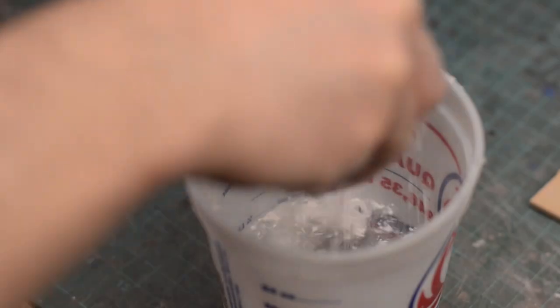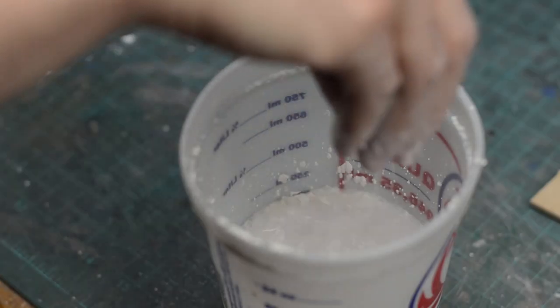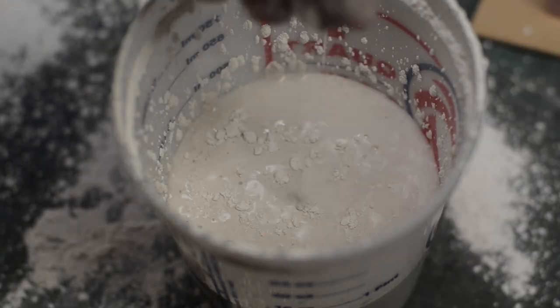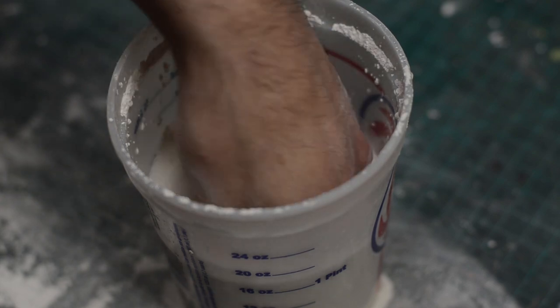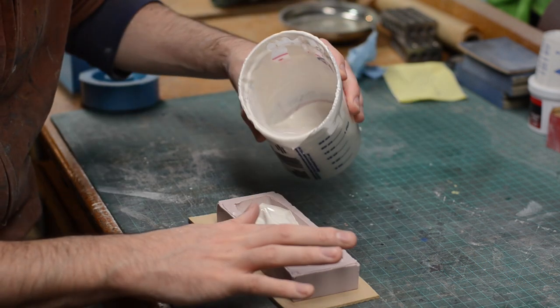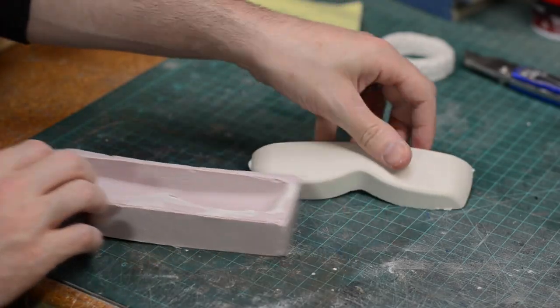Hydro-cal is a lot like plaster and is a very common material for making vacuum forming bucks. I got a bucket of water and started putting in handfuls of hydro-cal. You don't want to mix it right away — you want to let the water take as much hydro-cal as it wants to, so you keep adding handfuls until the hydro-cal gets caked up on the surface. Then you can mix it by hand, squeezing out any lumps, until it has the consistency of a milkshake. Then the hydro-cal gets dumped into your alginate mold and allowed to sit until it is rock solid — usually a few hours, but it doesn't hurt to let it sit overnight. Then you can pull the buck from the mold, clean it up or sand it a little bit, and it's ready for vacuum forming.